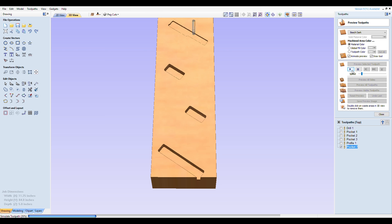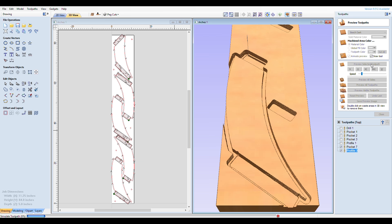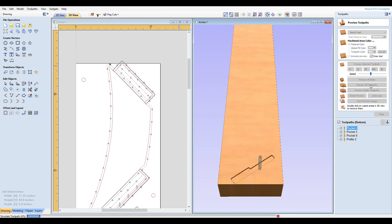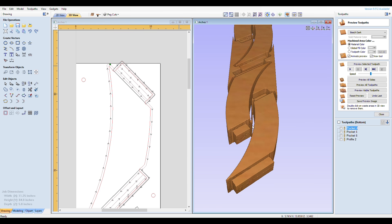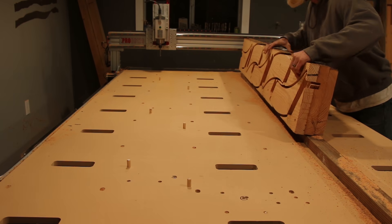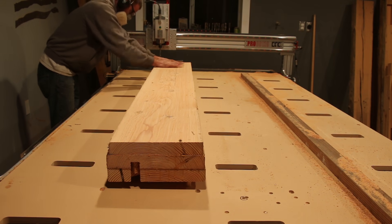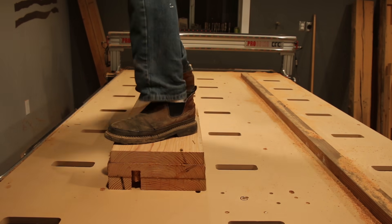Then I profiled the whole shape to a cut depth of 2.5 inches, which is as deep as the router bit will go. Using the double-sided feature, I switched to the underside and ran the same process, cutting the rest of the way through the 5-inch beam and leaving the tenon ends on the arches. I learned that it's better to place the dowel locations offset around the workpiece, so there's no chance of flipping the piece the wrong direction and having it still fit over the dowels.